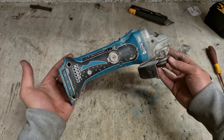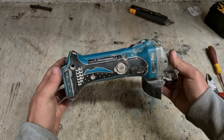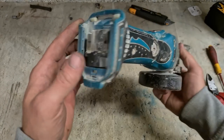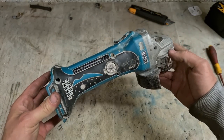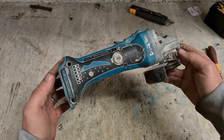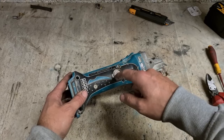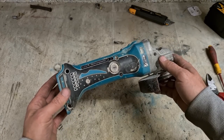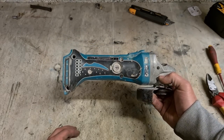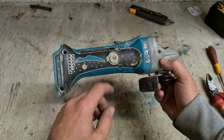These are convenience tools — good for cutting a couple of bolts, a little bit of work, nothing major. But because they are so convenient, you're obviously going to go for it more and more. As you can see with this one, there's dirt and dust on it — someone's probably using this for tiling. That's getting used and abused for a long period of time. It generates a lot of heat because there's a brushed motor, and eventually that heat builds up and starts melting the brushes. If you need a cordless grinder and you're going to be doing a fair bit of work with it, always get a brushless one — no matter what brand.